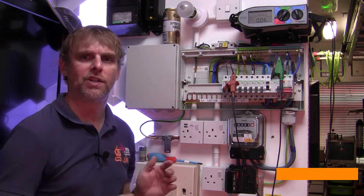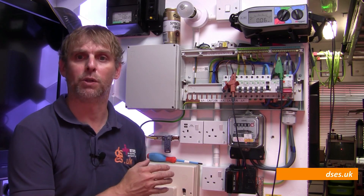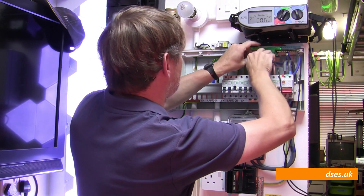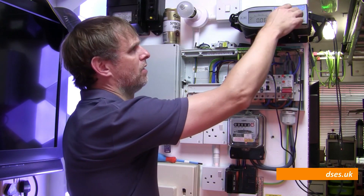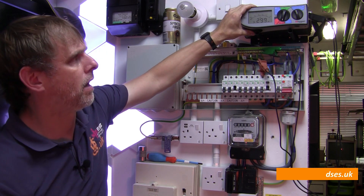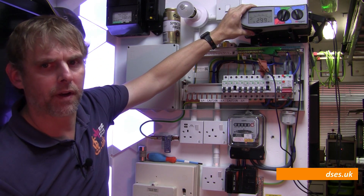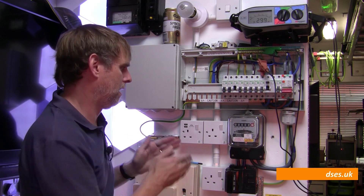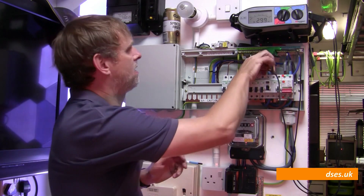To play it safe when doing line to neutral testing: first check for continuity, then test at 250 volts. If you have continuity, don't bother proceeding to an IR test, and if it fails at 250 volts, don't whack it up any higher. Even with this sensitive load still connected, I should still be able to test line and neutral joined together with respect to earth. By joining line and neutral, I'm blasting my test voltage up both wires at the same time so the potential difference between them is zero — most appliances should be okay with that. Let's do it now: probe on the earth bar, join line and neutral together, switch to 500 volts. Marvellous — off-scale high again at over 299 megaohms, exactly what I'd expect.